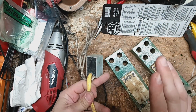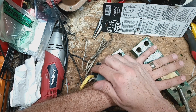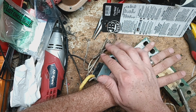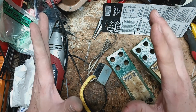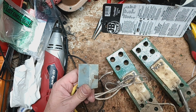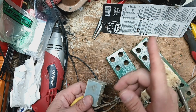But here's how you troubleshoot when you have a weird thing going on with your scale system. This will work on most brands of this livestock stuff or scales in general. The symptoms, maybe three or four, that we see over the phone or in person: the display monitor, the computer part that displays the weight and everything, will show different symptoms. You'll either see the numbers bounce around all over the place. They'll go plus a bunch of numbers, negative a bunch of numbers, or just won't settle down. That's one symptom you'll see.